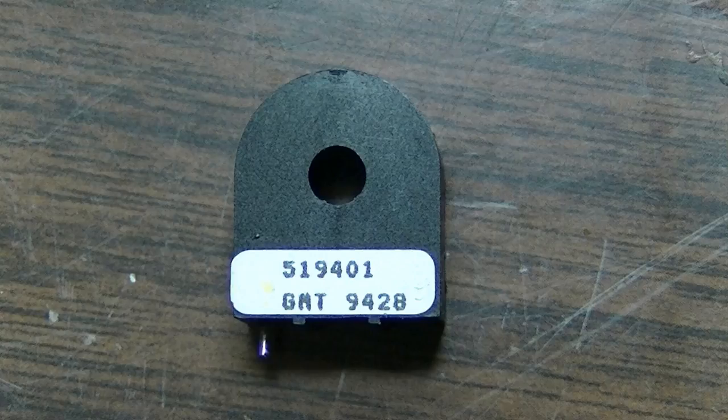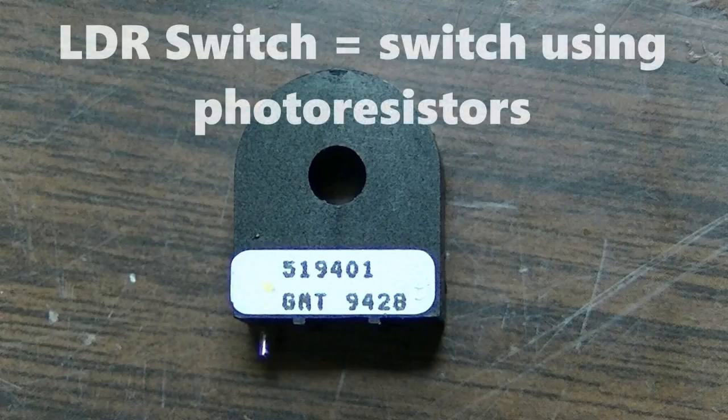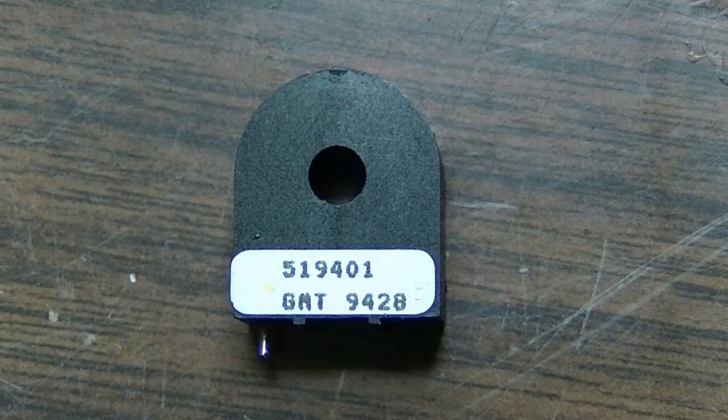Okay. When did you guys stop making the DC-3? Oh, geez, it's been a long time ago. We stopped making it about 15 years ago or so. Yeah, it's more of a 90s. Like, 93 was the first year for those, something like that? Maybe that or slightly later. 93, 94 sounds about right to me. I remember when the boss first introduced it. I remember he said, "Hey, I discovered by adding an extra 12AX7, I could eliminate some LDR switching devices." LDRs were being used for channel switching. Yeah, it's a nice amp. I don't like the power board on the back because it's gotten hot over the years. But other than that, it's great sounding. I think our EL84 amps all run really hot.